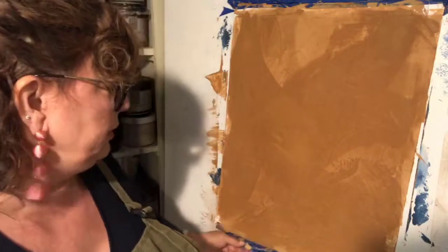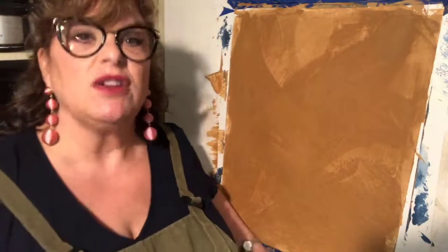When would I add wax? When it's completely dry — that's when you wax this. This must be waxed. It cannot have an acrylic top coat on it; it cannot have an acrylic wax. It has to have real wax and it has to be able to breathe. If you put something other than wax on here that doesn't allow this to breathe, it will simply delaminate — it will just peel right off and probably take chunks of the finish with it.